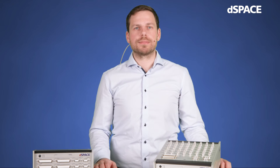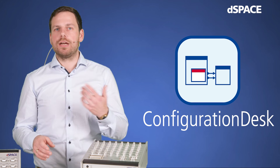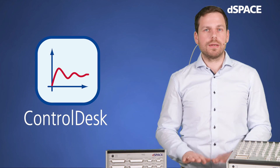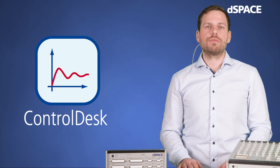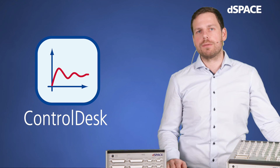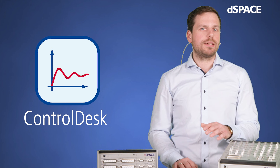This is where our comprehensive dSpace toolchain comes into play. The MicroLab Box 2 works with our implementation tool ConfigurationDesk. All hardware-related things like I/O channel assignment and the specification of what functionality a channel shall provide are done within ConfigurationDesk, which results in a clear separation between the hardware configuration and your Simulink model. This approach gives you the flexibility to modify or exchange your model without having to reconfigure the I/O. And as soon as your application is running, our experiment and instrumentation software ControlDesk lets you perform measurements and visualize the data in real time, so you can quickly see if everything performs as expected. You can even use it to change parameters of your Simulink model on the fly without having to recompile anything. Of course, our software portfolio contains many more tools for things like test automation, bus inspection, etc., but explaining those would be too much for this video.